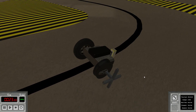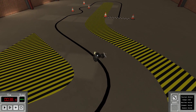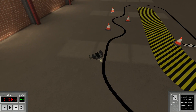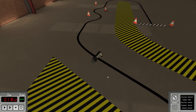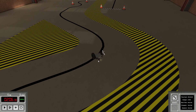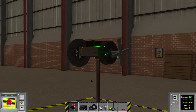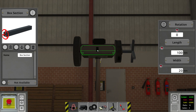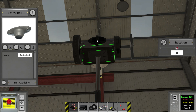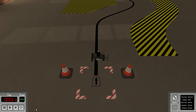It's kind of working — it is wonky, but I didn't expect anything else. As soon as I saw this in the comments, I was pretty sure it was going to work. Something went really wrong there though. I think we need to stabilize this robot. That's crazy, but it should be an easy fix. I'm going to place a stabilization wheel and a caster ball on the other side, and now we shouldn't tip over anymore. Let's speed this up and see.